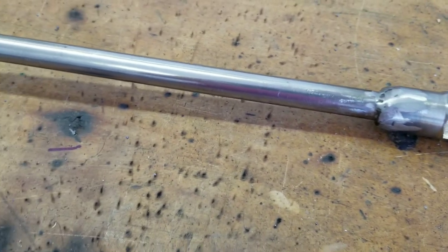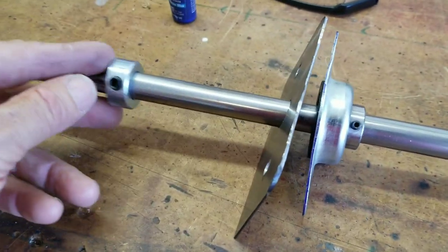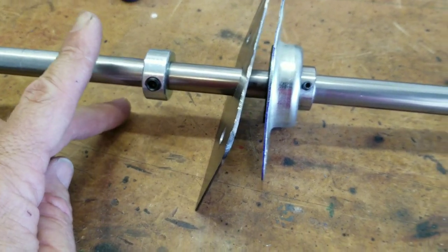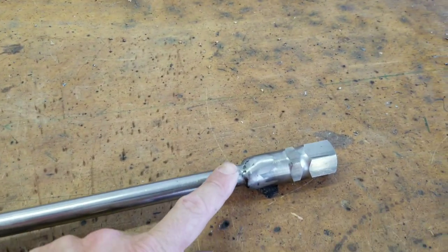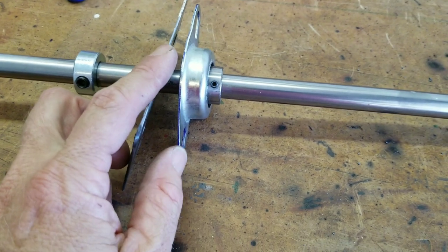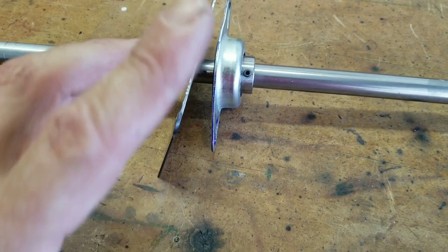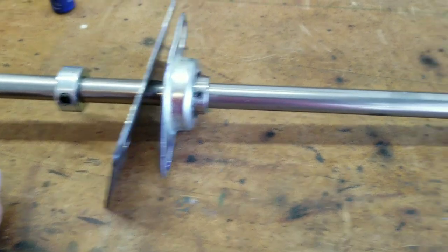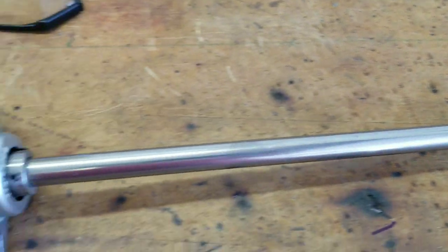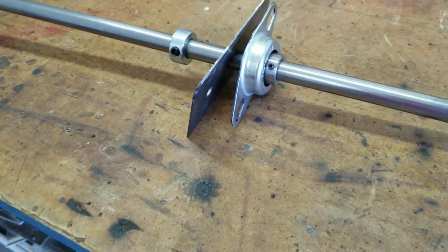That's all welded up. Now, when you're doing this sort of thing, remember: any bearings you have or locking collars need to be on the shaft first, because once you weld your pitman arms on and your quick release on, these are no longer removable. So it's important to make sure you put them on there first. I put this all on the car, bolted it all down, and then left them on there after I tacked that on. It's important to remember to put that on there.